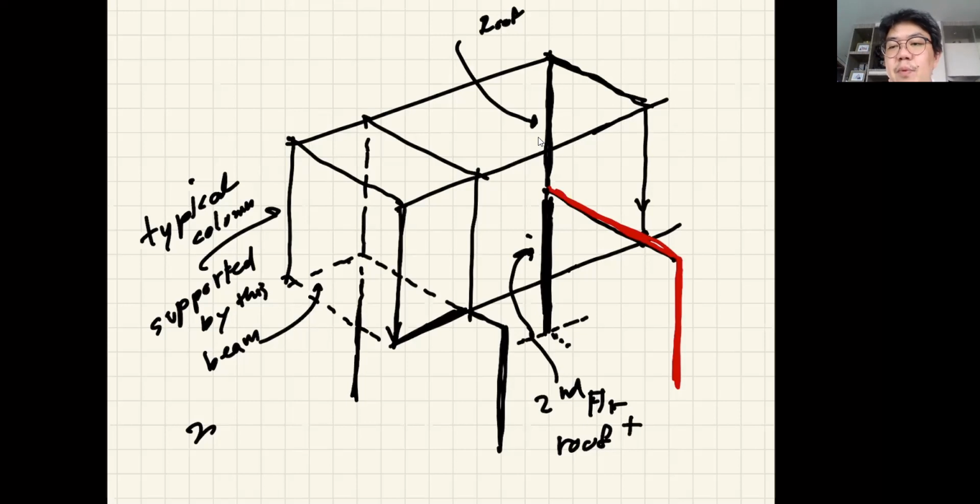And like I say, if you put the ground floor on the structural system, it means that your foundation will have one more floor to carry. It's going to cost more in terms of piles and everything. But the good side is that you have a system that will go together. So the ground floor will not have problems with settlement or anything. It will sit solidly on your structure.